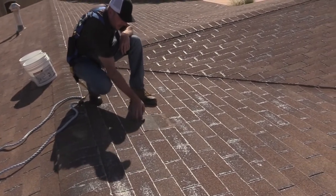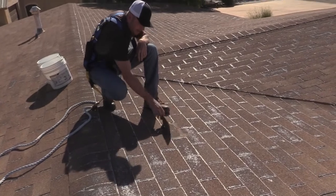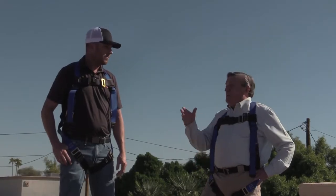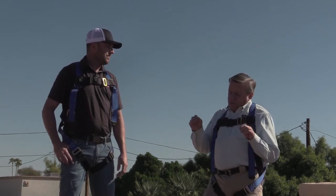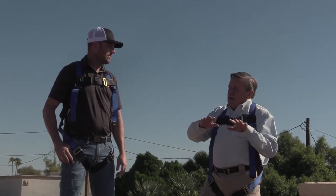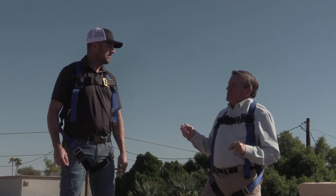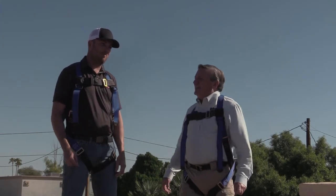That's a real key — that's an old shingle you can see from anywhere. It sparkles and shines, catches your eye from the road. The UV light has killed that shingle when it's down to that point. And then of course missing shingles — that wispy fiberglass string shining at you in the sun is a whisper, but missing shingles say, hey, somebody needs to pay attention up here.